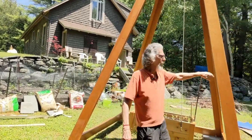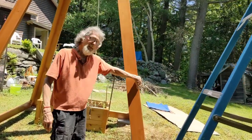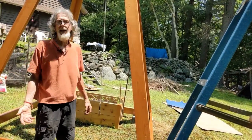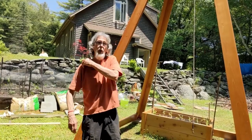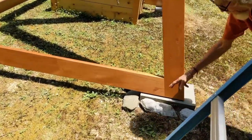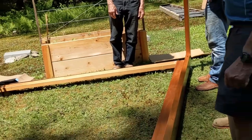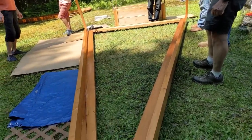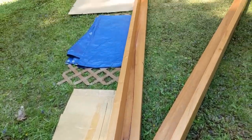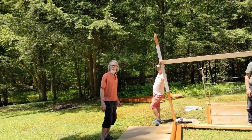This is a joint here and it's got dominoes in it for alignment. It's not 90 degrees because of the slant, so you have to calculate that. Once I laid it out in a scale drawing I knew what my angles were — these are about 17 degrees. The sides are a little over 205 inches long, and then I have a cap piece that will go on at the very top. It's going to be somewhere between 16 and a half to 17 feet tall with an 8-foot base.